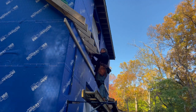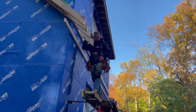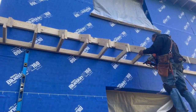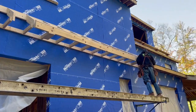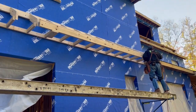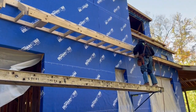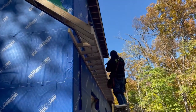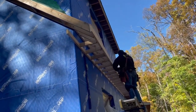It's time for us to start constructing portions of the house that keep with the modern farmhouse style, as well as the looks Amy and I like. We wanted to add some character to the back side of the house. We were wary of the backside lacking some flavor. We aligned the back pent roof with the pitch of the porch roof. This pent roof will not only break up the long flat wall, but also provide some cover for the guest suite windows.